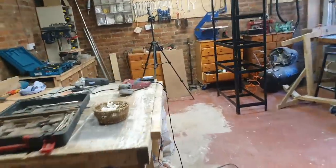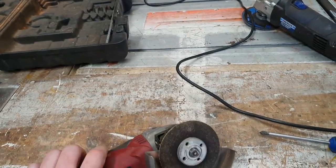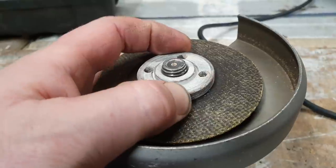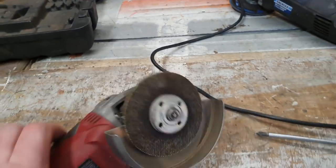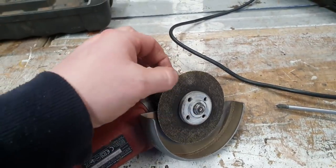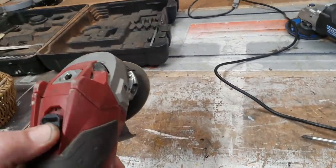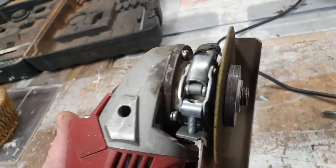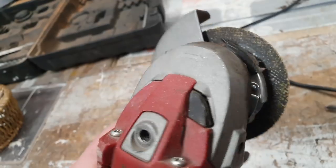The Einhell grinder was my favourite one, purchased from Toolstation a long, long time ago. She's good in your hand - nice red tip, perfect fit, hold her in your left hand. But the trouble is the arbor - there's just a little side to side weeble wobble on the bearing. When you've got the big heavy grinding disc on, it vibrates that much it keeps knocking this off.